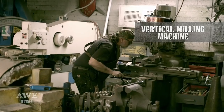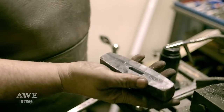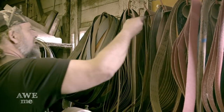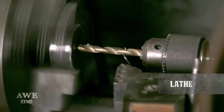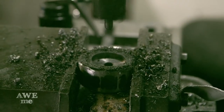Now it's on the vertical milling machine to mill the slot for the tang. I grind the swords with a progressively finer belt before I take it to polish — I have about 12 different types of belts that I use on my belt grinder, and each one has a different application. I'm using a lathe to drill a centered hole through the pommel, which I'll use on the milling machine with a counterbore to drill the seats for the gemstones.